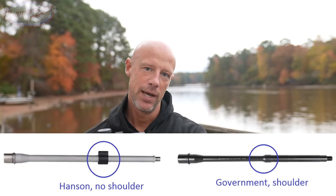The handguard is 13.5 inches, an M-LOK affair with M-LOK slots at the 3, 6, and 9 o'clock positions. At the offset positions it's cut deeply for weight savings and heat dissipation. On top there's a 1913 rail all the way back, scalloped out for weight savings while maintaining durability. Where it mates up with the receiver, it has anti-rotation built into the body of the handguard, plus a steel nut going into a steel barrel nut that clamps it down and automatically centers it. I've used this on multiple builds and never had a single issue.